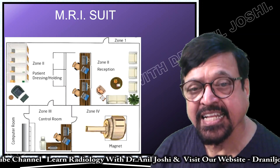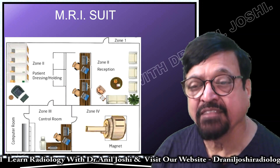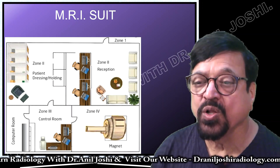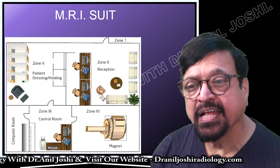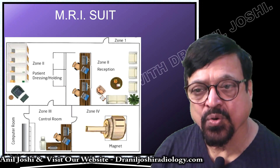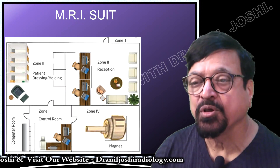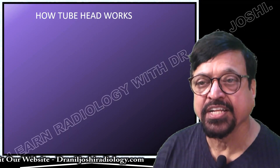The cold head is in the magnet room. We are going to show how it looks and where it is situated. It has to be away from the machine zone, computer zone, and operator zone, because it may lead to quenching of the helium if it is not maintained properly.